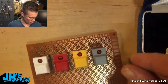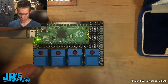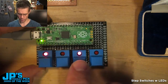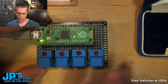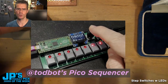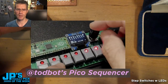This works well with these really nice proto boards that Adafruit has. With this code right now, when it starts up it does a couple little blinks and then it waits for me to pick a mode. If I pick the first mode, this is now in MIDI toggle mode, so I have four different MIDI CCs that I can toggle on and off. That's all done in software, so there's no connection between the LED and the switch in the mechanism itself. You can decide in software how to respond to clicks using either an on-off of the LED or a PWM if you want to fade them.